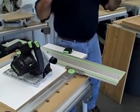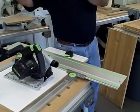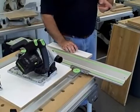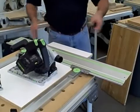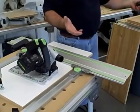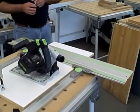Say I'm building cabinets and doing the sides. For instance, upper cabinets in the kitchen. What I would normally do with a Festool TS-55 and a guide rail is take my guide rail, put it along the length of it. My two 1400s put together as a larger single unit, and I would rip a nice clean edge.